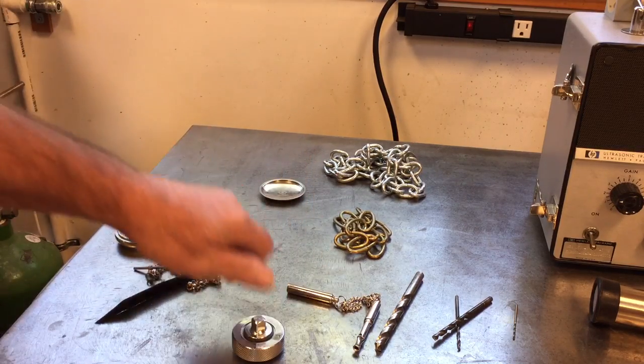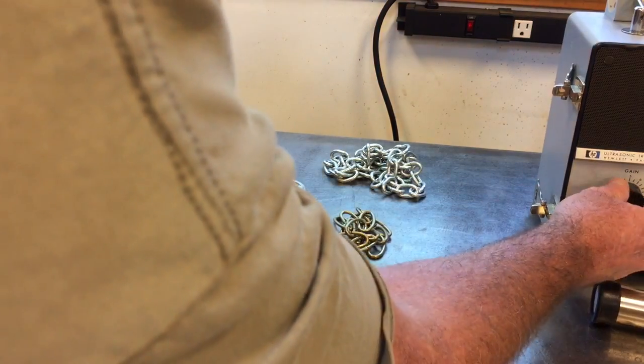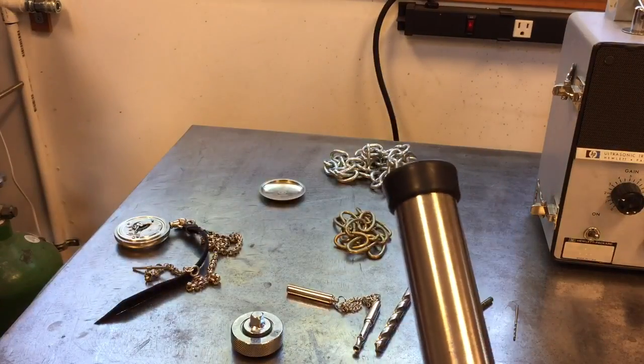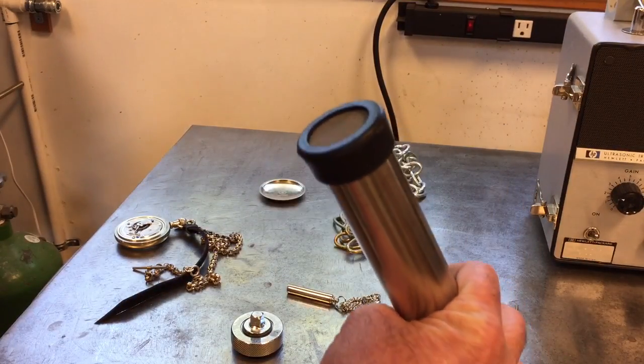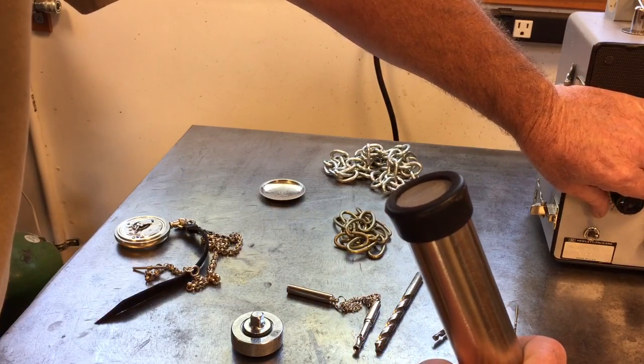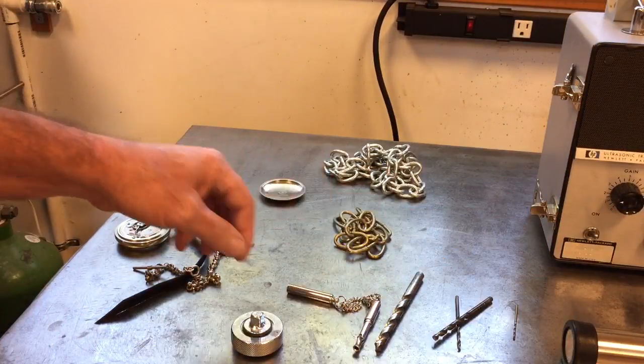So there's regular sounds. Now I'll turn this thing on. And the way you test this is with a hissing sound — you hiss or sniff. And you can see how sensitive it is to that. It's turbulence that it's picking up, which generates the ultrasonic sounds.